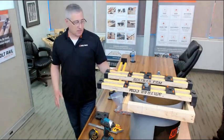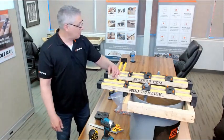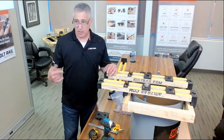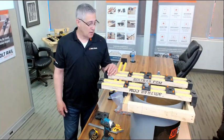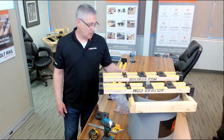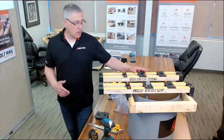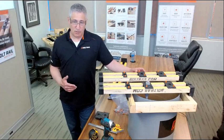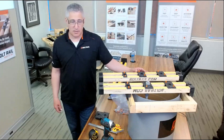Yeah, so that's kind of the gist of it. If you guys have any questions, you can type them in or unmute yourselves, and just feel free to ask. But that's it. It's a simple little tool. It saves a huge amount of time for a task that's really critical coming out of the ground. If the anchor bolts are right, the rest of your project will fall in place fairly easily. If the anchor bolts are wrong, you're going to be fighting the rest of that steel work.